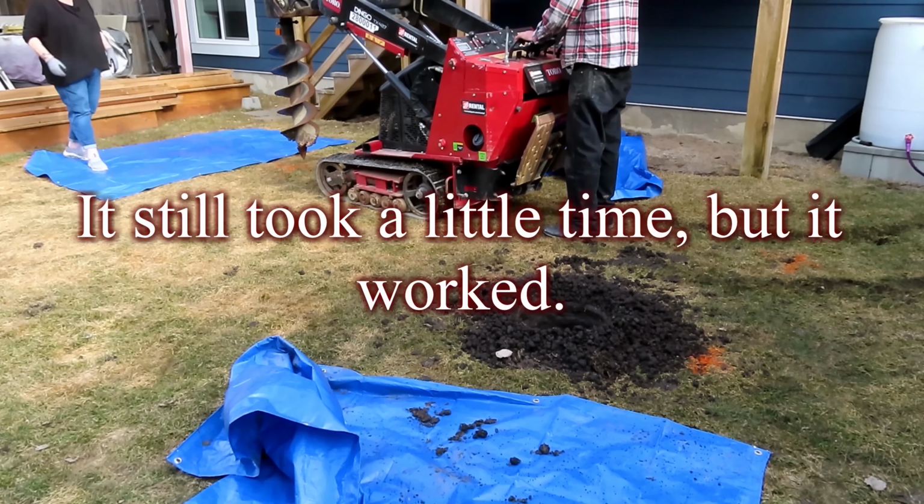Attach an eaves trough onto the beam to catch the water. To make it look better, I first attached a 2x6 to the beam and cladded it with aluminum fascia. I then screwed the eaves trough to the 2x6. Do a water test to make sure everything's working correctly. Attach the eaves trough. Do a final water test.